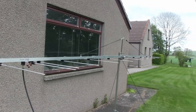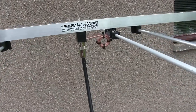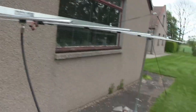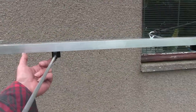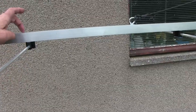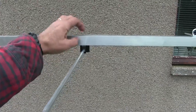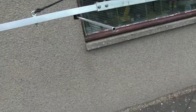Here's the antenna completed. You can see a little bow on there. The elements are held on by self-tapping screws, and it's only 2mm thick, so whilst that's ample, you need to be careful how much torque you apply. If you strip one, getting out of jail would be to drill all the way through and use a longer screw so you've got more material, or the last option could be a 3mm or an eighth screw with a nut, or you could use pipe clamps.